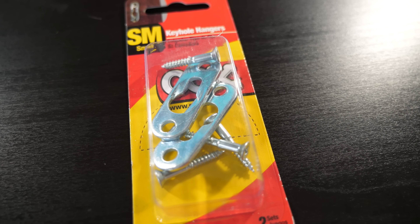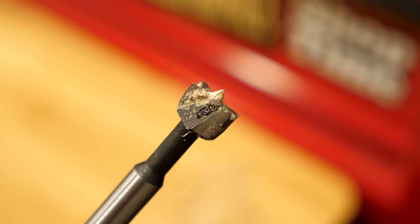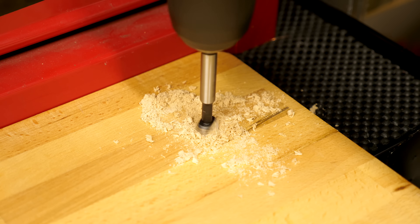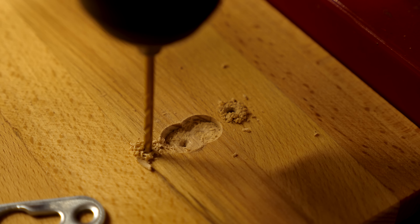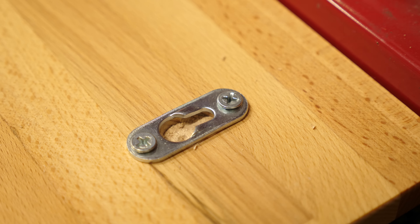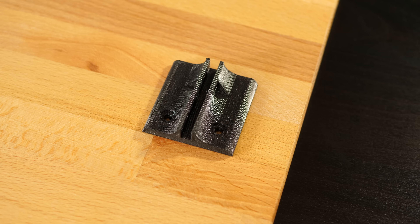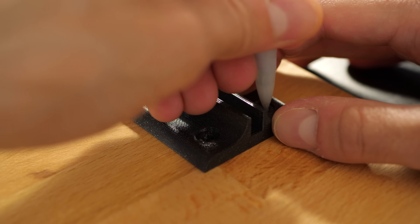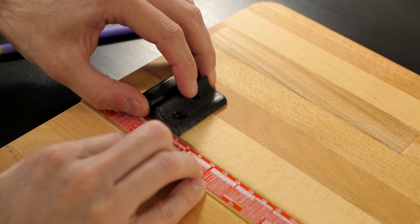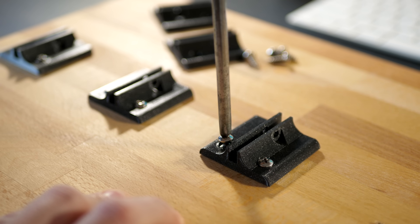To mount the board to the wall, I picked up some keyhole brackets. I drilled several holes in the back of the board using a Forstner bit — it's a special kind of drill bit that's able to make holes with flat bottoms. I didn't need to go too deep, just enough to make room for the screw heads sticking out of the wall when they were inside the keyhole. Then I pre-drilled some smaller holes for screws and got the keyhole brackets installed. The cutting board came with a hole already in one end, and I wanted to cover that with one of the mic brackets, so I set it in place and traced the screw holes on the board. I took measurements off of that to figure out where to put the rest of the brackets so they'd be evenly spaced, pre-drilled all those screw holes to keep the wood from splitting, then attached the brackets.